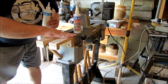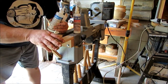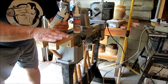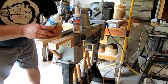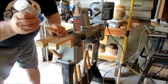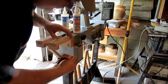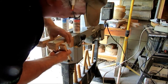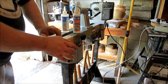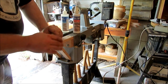I have this end nice and flush and smooth at 220. I decided to put a little glue in my supports there — the vibrations from the sander caused one to fall out. They're in there very tight but if the sander is going to knock it out, I can't have that. I'd be erring my ways if I didn't tell you I went ahead and put some glue in here. A screw might not hurt but I'll try that later. So I'm putting a little CA glue on one end — I'm not putting glue on the end where it's up against the lathe. It sits behind that bolt and wedges in quite well. I'll do the other side and then I want to do a little hand sanding on the inside edges and then we're ready to go.